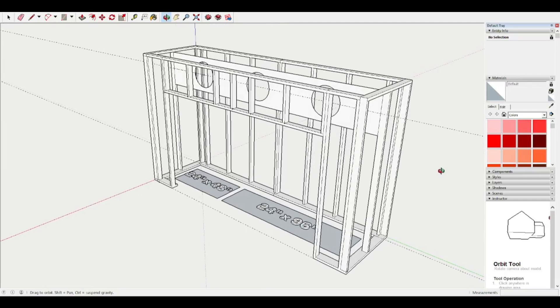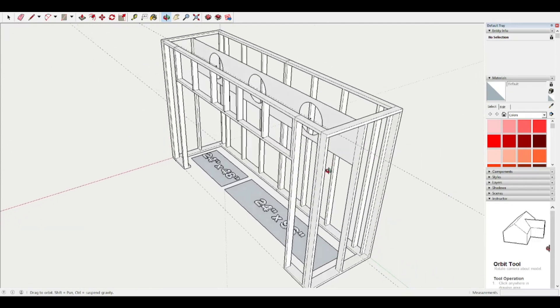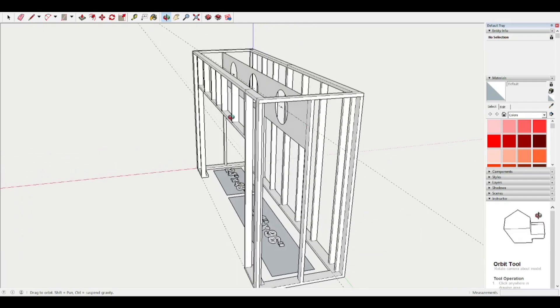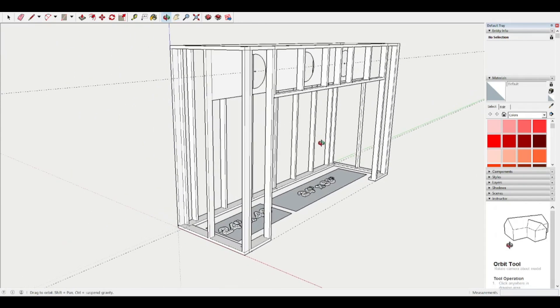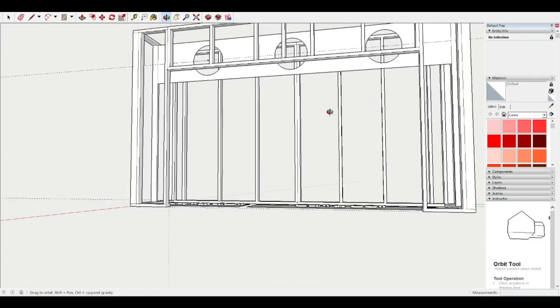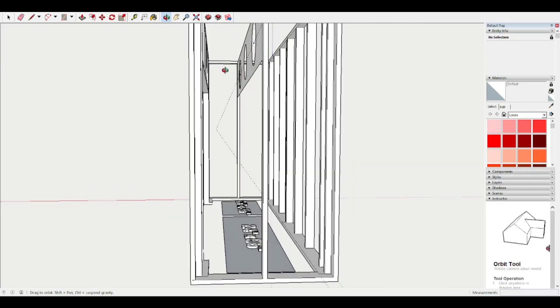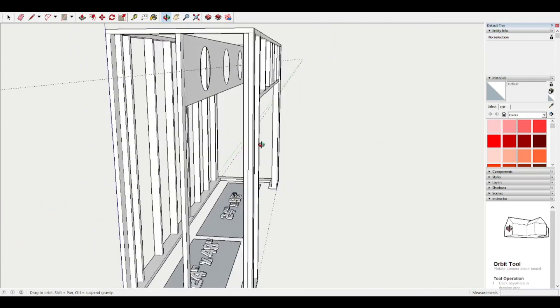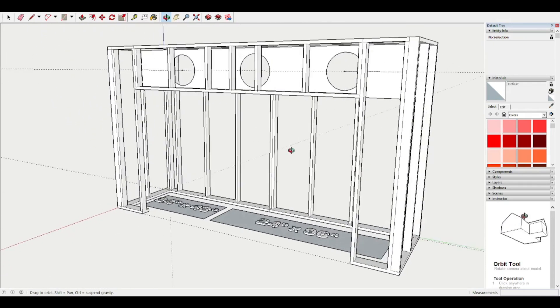This is a simple drawing I made of the kiln before I started. The stud spacing might deviate a little from the actual build, but basically the fans are mounted up top, the lumber is in here lengthwise with baffles coming down. We have positive pressure air on one side, the air flows down through the stacks, and negative pressure where the fans are pulling air back up through — standard kiln airflow physics. It's a smaller narrow chamber but it makes sense for the pallets I'm using.